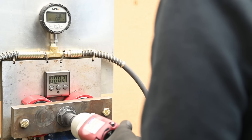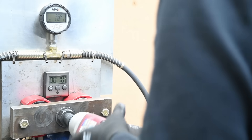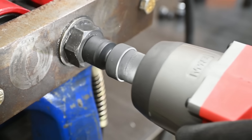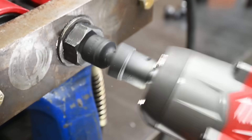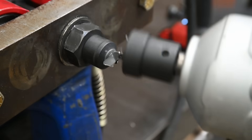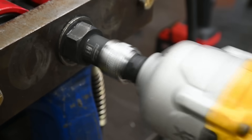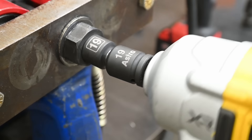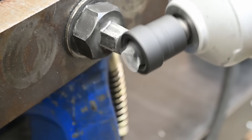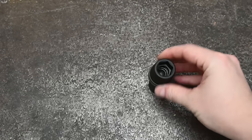When we dyno test it straight on, that only bumps up to 317, so it's not just an angle approach thing — more of an overall design matter. In durability testing, the Icon through the same timed forward and reverse, straight on and at an angle, with the Milwaukee Gen 3 high torque did pretty well, but the DeWalt DCF961 — about three hits in — cracks it in half again. Something the modular, half-the-price Power Built had no trouble with. Like with the 3/8", it's not a hardness issue — it's material thickness. The pinhole doesn't leave enough meat surrounding it. Lifetime warranty, but this would be our third time visiting the store for this sort of thing.